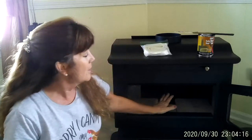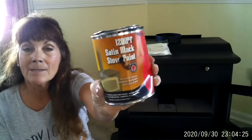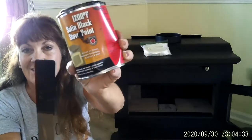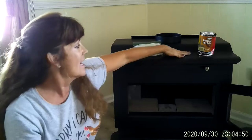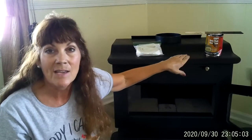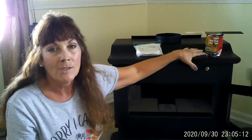Some bricks are missing because they still need to be cut. On this stove I used a 1200 satin black stove paint from Amazon, very cheap. You stir it up - don't shake it - and it says to use a nylon painting brush. I used that but I'm going to go back over it with a foam brush because I could see streaks. I'm a perfectionist - it's my dream, my vision. Lightly coat it, put two coats on.